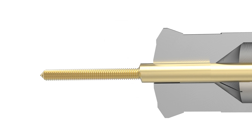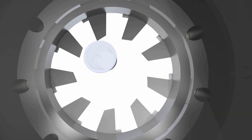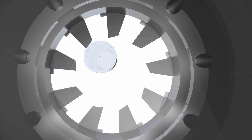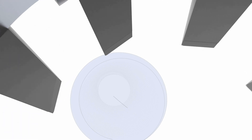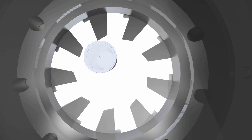It's a really unique process — sort of like an inside-out saw. You're sharing the work with a whole series of teeth: six, nine, or twelve inserts. Each one of those unique shapes is taking a very small bite per pass, reducing stress and creating a very fast, accurate form with really incredible surface finishes.